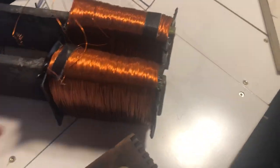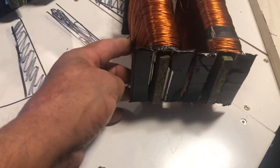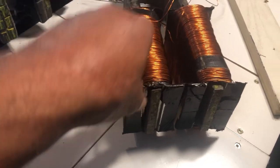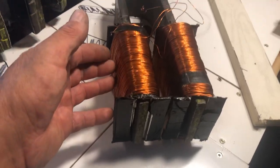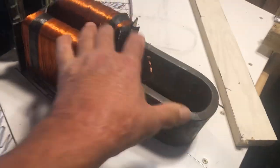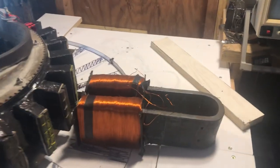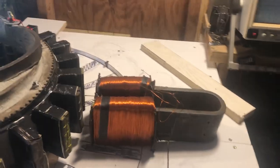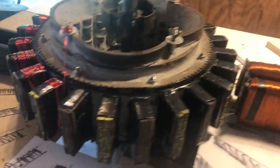So if that's 1,250 turns, and I'm only a half inch thick on the belly side and the top, I'd say I'm a good 3/8 inch thick, maybe half inch, if you balance it out. So if I can go another half inch, I can get another 1,250 turns on it, right? You would assume. And by doing so, you'd have a lot more resistance. So I have too much resistance in here. But one thing good about the thinner wire is you create higher voltage. So we'll talk about that down the road in the array of the wheel.